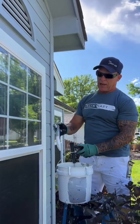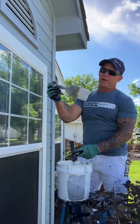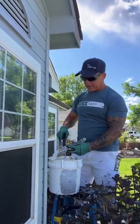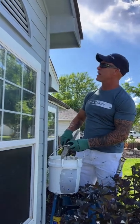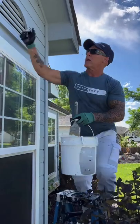I'm using a Premier Riverdale brush with Chinex filaments. For exteriors, a mesh brush works well because the paint will dry and stick on those filaments but they'll clean off fast and easy at the end of the day. First coat: thin coat. Second coat: full coat.